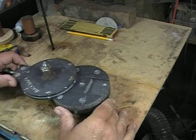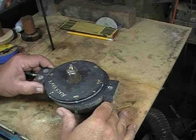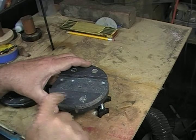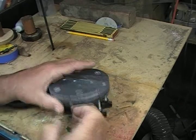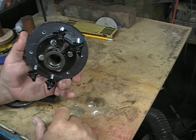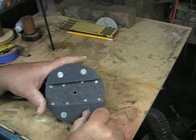And then, when I was sure that my slide fit and did not wobble or play, I took the slide out of the way — you can leave it there, it doesn't matter. And then I drilled, countersunk, and tapped these four bolts. Now, these can go through; in fact, they do go through. I just didn't put another on the back side. But I like the drill and tap part — makes it more machining.